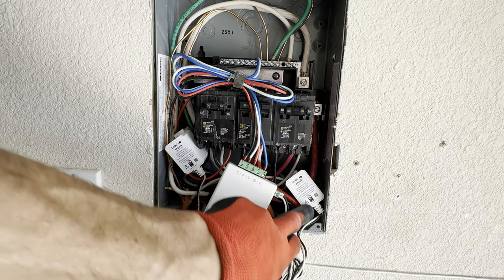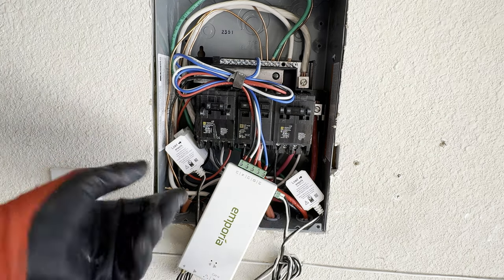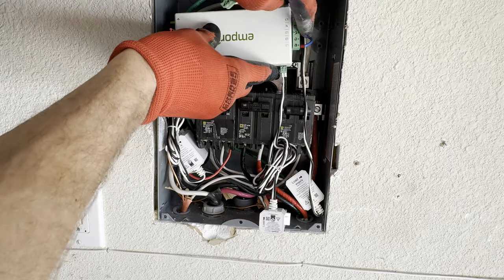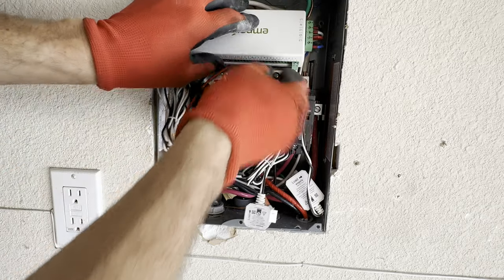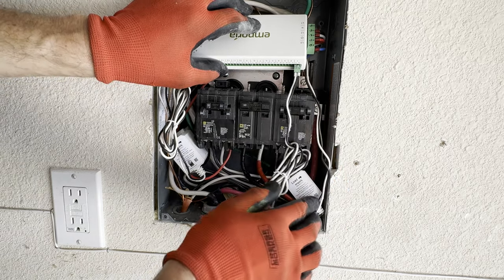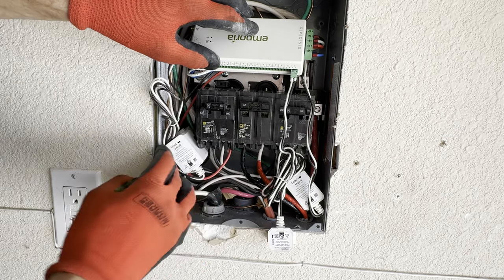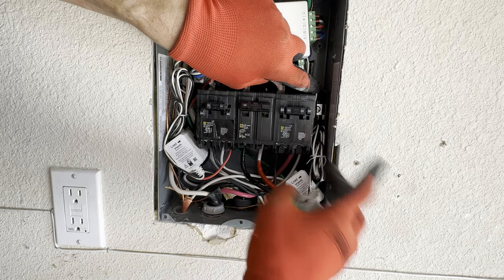The red wire is going to the B line and the black wire to the A line — that's how I like to put it. We're going to have this wire extend and wrap around this side of the panel. Power is already connected and this is going to be our B side. It's kind of upside down, reversed, which is fine — it doesn't really matter which way you put it in, as long as you can organize the wires. There are a lot of wires from this thing, so I'm going to put it on this side of the breaker.